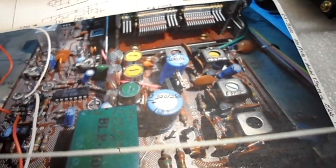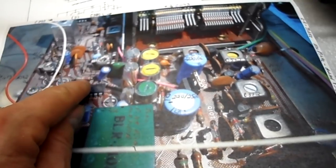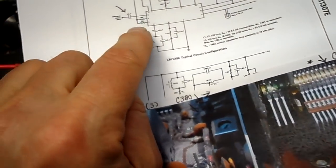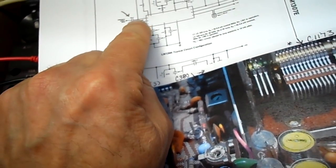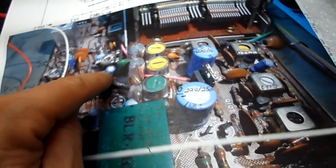Backtracking again — AM is fine, FM stereo and everything is all messed up. Here's our 22k resistors, and that's what they're showing here — 22k. That comes from the 12 volts. Here's our input capacitor right there going to pin 3, and that's the one I changed. I put back the original — tacked it on underneath the board right there — and my tuning is back to the middle. I'm still distorted but I have my stereo light.